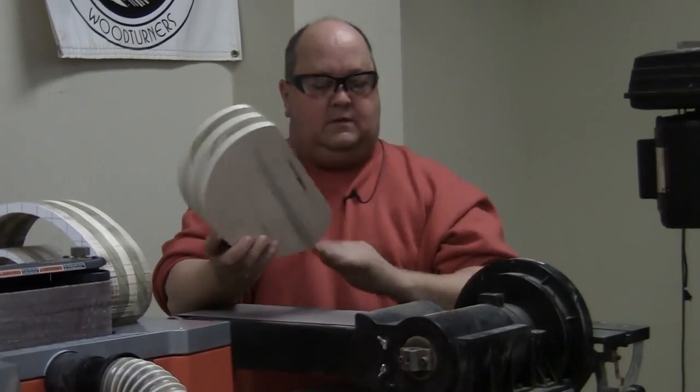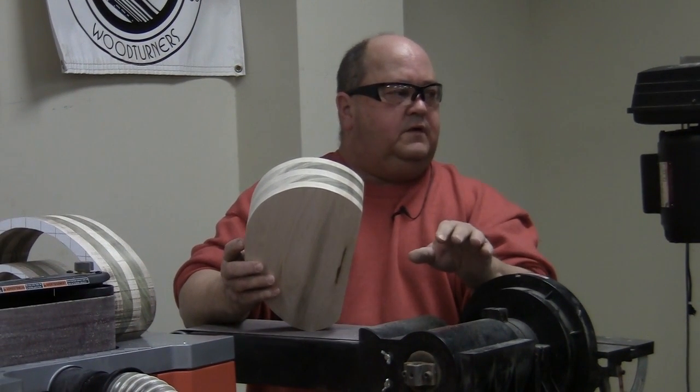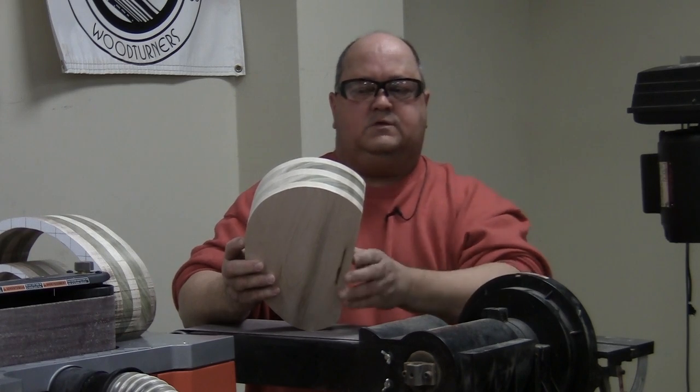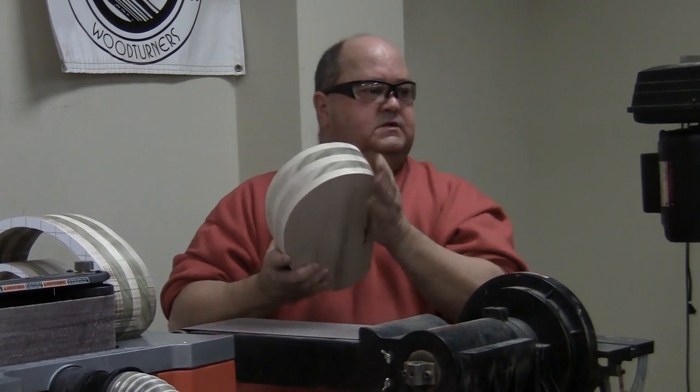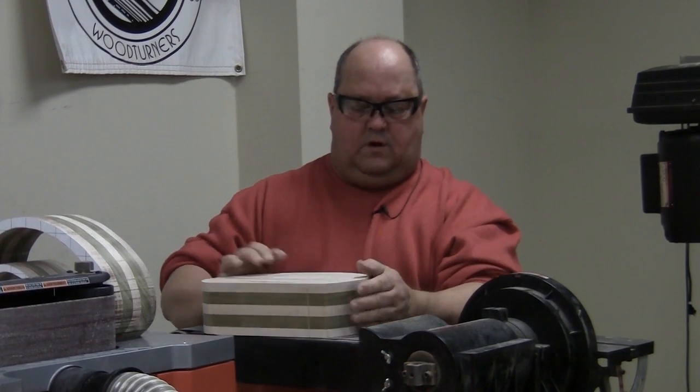When you're going to do this, I've got a small sanding station that I brought in here and left in here. It works great for almost everything you do, but when you do the bandsaw boxes, you want to keep a consistent level on here. Now, when you're going across here, if you've got a 4-inch belt, you've got to constantly keep moving to keep it on here.